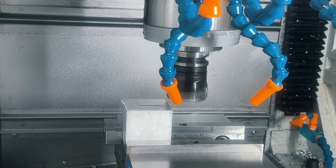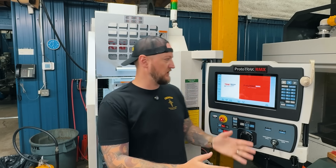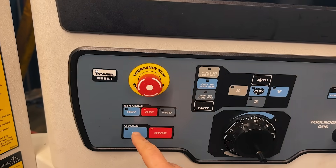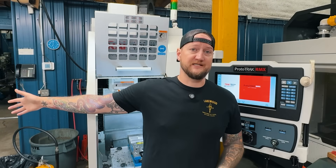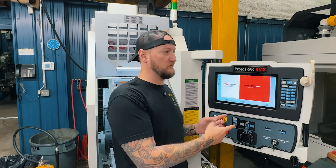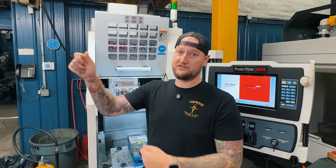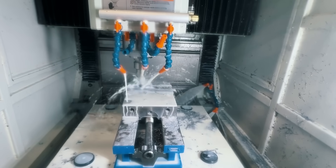So we decided all little stuff we're going to put in this machine here right beside the lathe. We've already kind of gone through how you can program conversational in the Prototrack RMX — works really well, good for tool room stuff, we've programmed production stuff out of it. But I have all these CAM programs that we use on our other machines. We can take them and stick them directly in here without having to do much modification — we just change the post and run them. We're not having to start from zero. If I can fit it in that machine, I can also take that program, repost it out, stick it in here, and away we go. We've been running production on this and it's been going very well.